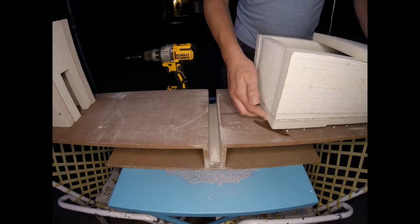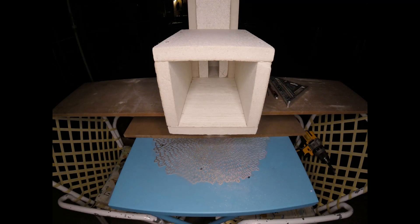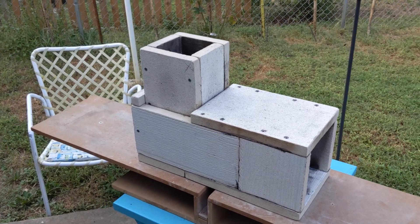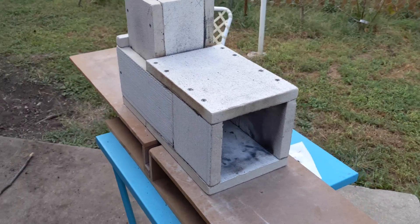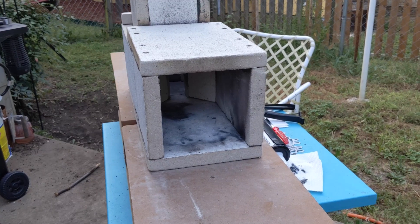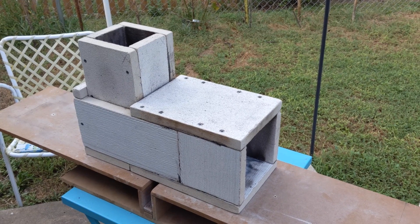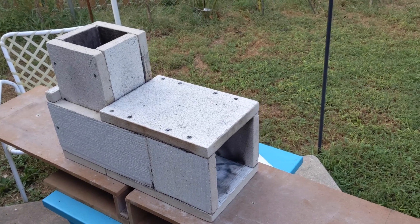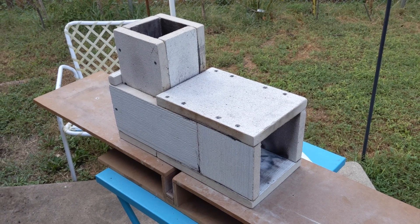My firebox needs to be roughly 12 inches deep and six inches wide. I went with six inches tall because I was not going to make that V-bottom that they have in those cast risers or batch boxes. I put the thing together, and before I actually finished it, I wanted to do a test burn — that's why it's all black and ashy on the inside. However, it seems like that was the wrong thing to do, as some of the vermiculite board got a little more brittle. So what I would do next time is don't burn it until it's done.